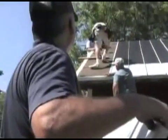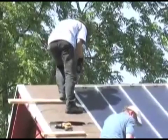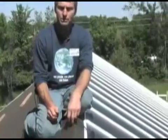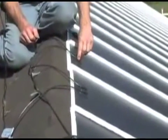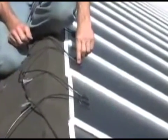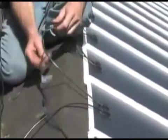These are the same metal roofing pans that you saw down below. What we've done is hoisted them up just like regular metal roofing, screwed them down, and they lap over each other all the way across the roof. These are the electric terminals on top of the laminates, and we've just daisy chained them together in a series string.